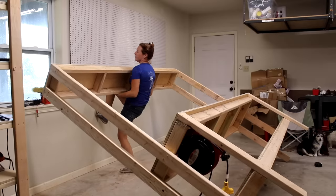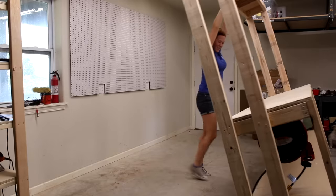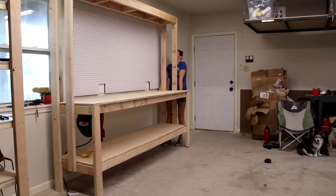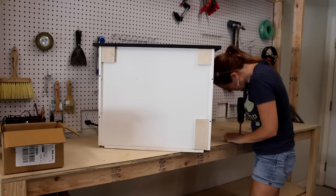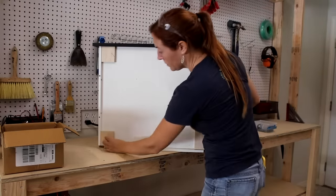The very last thing I did was add rolling drawers. I was getting rid of an IKEA bed and held onto the drawers so I could add some casters to the bottom and utilize the bottommost area of this workbench. If you don't have drawers already, you can use scrap plywood to quickly put some together. I cut some half-inch plywood blocks from cutoffs and screwed them to the corners of the drawers, giving me solid material for the casters to attach to. I chose non-swiveling casters so the drawers will pull in and out like they're on rails rather than swiveling all over the place.